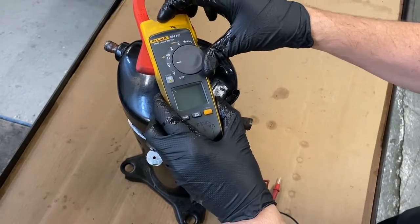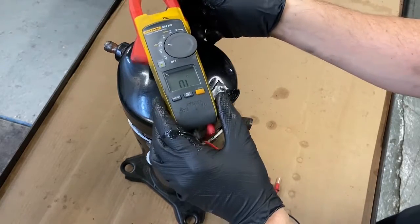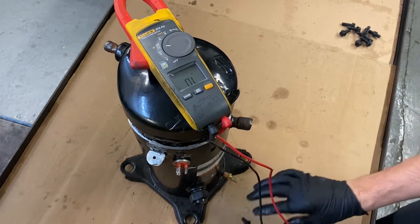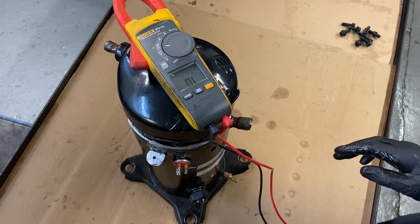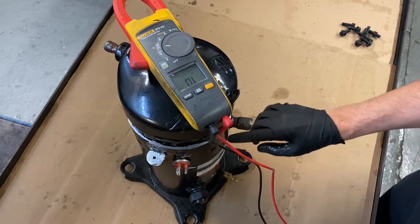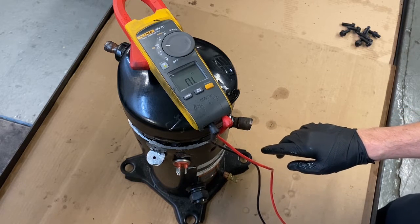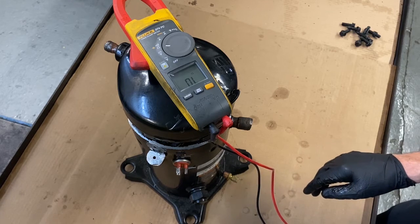The first thing you want to do is ohm out the compressor. This is a ZF compressor, one of our low temp compressors — it's a K4 model, which means it's a liquid injection compressor. The first step in troubleshooting a scroll compressor is to get Copeland Mobile out and scan that model number. This is a 19A, so it's from January 2019 — almost two years old.